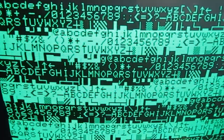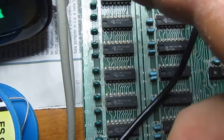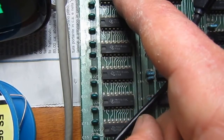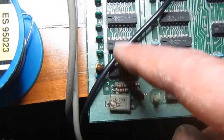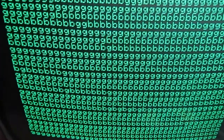Progress: the red wire is connected to 5 volts and the blue wire is on the only select that works with this test. There is some bad RAM and it's quite random - every screen is different with the bad RAM moving around. Probably one or more of these chips is faulty. Each chip handles one bit, so I'll try to identify the bad one by checking levels on each chip or piggybacking a known-good chip over each one to see when the test shows all good.